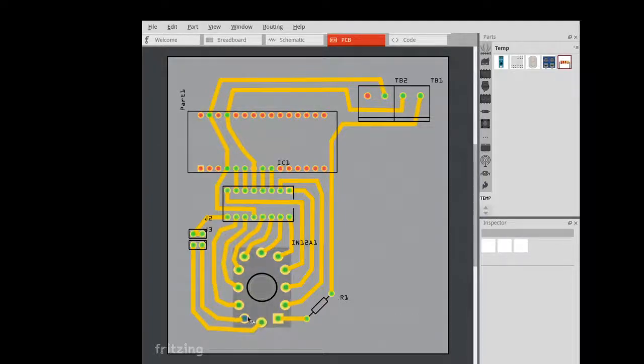You can turn this on, or you can turn this on, or you could turn them both on. But you're only using one output. So in a real circuit, if you wanted to use the decimal point, you'd have to add another IC like this, which would then control that decimal point as well.